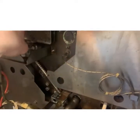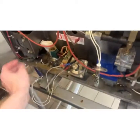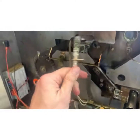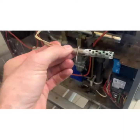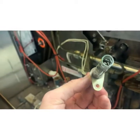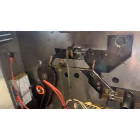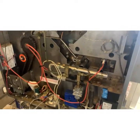So, yeah — crazy, because it wasn't fully failed. If you were a technician out here and didn't understand how this worked and you called me, I would have asked, 'Is this thing lit up?' And you would have said yes — and you'd have been 100% right. But it wasn't lit up enough. All right, we're going to cut the zip ties, get our new one wired in proper, then we'll fire it up, talk through the sequence of operations, and make sure we don't have anything else going on.